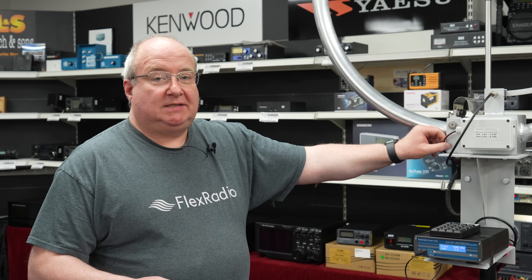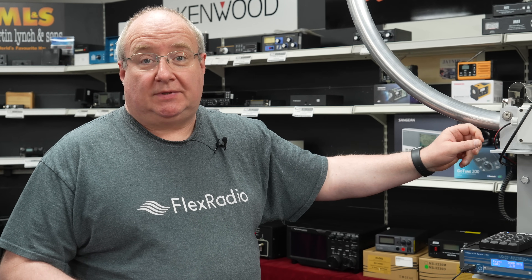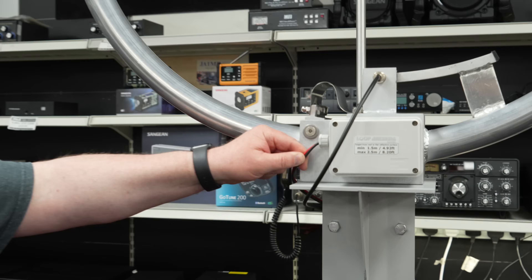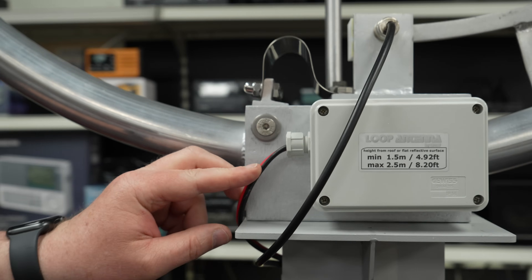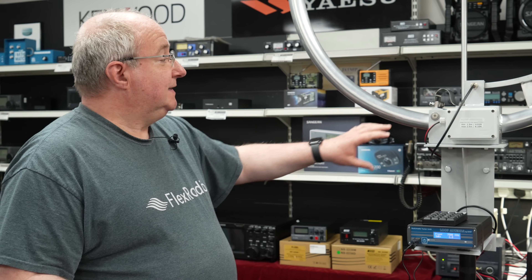The question about the DC motor supply cable: what type should I use? Just a good quality heavy duty DC cable — something like 2.5mm arctic cable is really good, especially in the garden. Make sure you clearly mark it as DC. Red and black DC cable is perfect, nice and chunky for a long run. You can run it in a bit of water pipe to protect it.